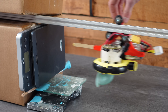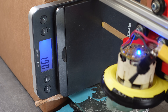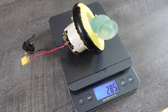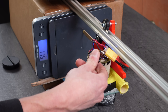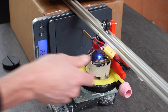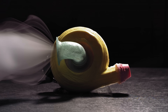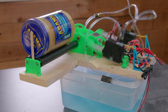The snail blower was working quite well and I wanted to know how much thrust it could generate. To measure thrust I mounted it on a rail with roller wheels and had it push into a scale. At full power it was doing about 190 grams of thrust — not great considering the whole thing weighs about 290 grams. The exhaust opening was 21 millimeters in diameter, the same size as the intake. Since centrifugal impellers are better at generating static pressure, choking the flow a bit to increase exit velocity helped — a new constricting nozzle increased thrust by 14%, bringing it to 220 grams at 350 watts. That's pretty inefficient.